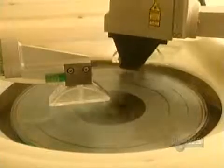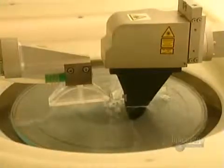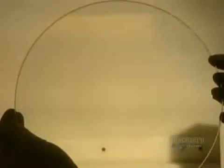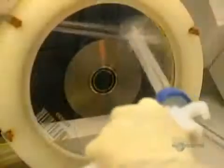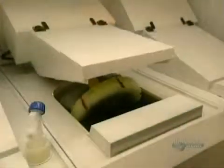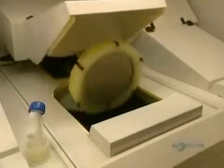This developer has two spouts. One applies deionized water and the other sprays a solution to develop the data etched on the glass. The information is now engraved on the disc. The disc is placed in this metal coating equipment. The next step consists of applying a thin coating of nickel and vanadium. This electroforming process results in the master, from which discs will be made.